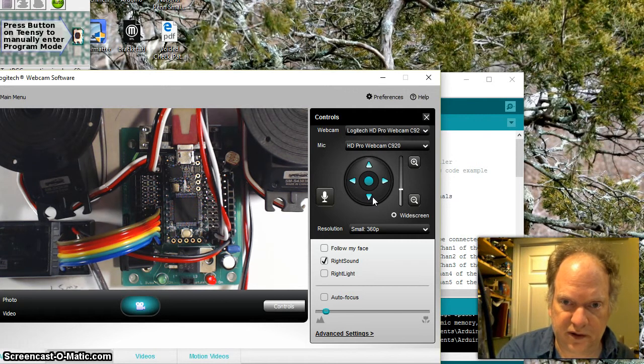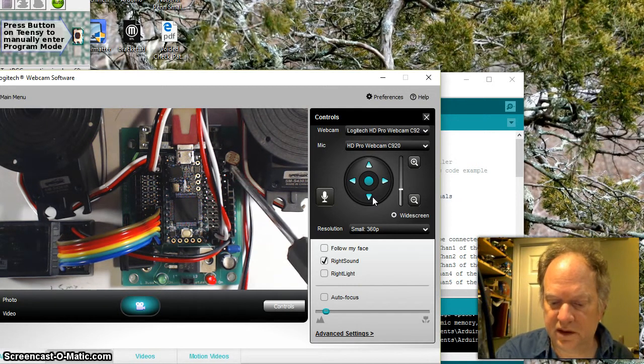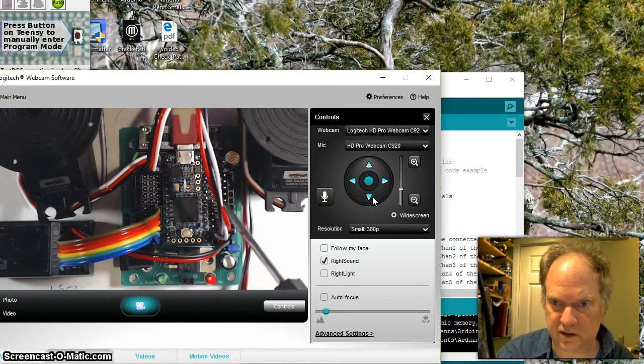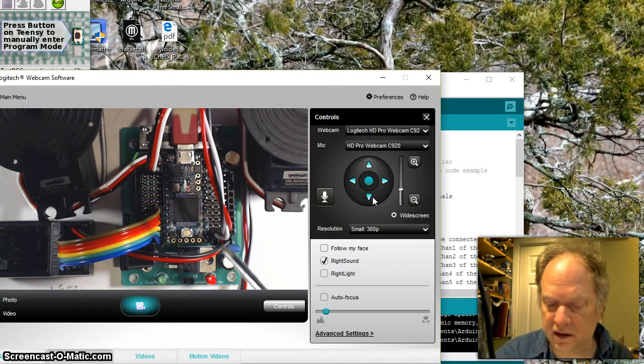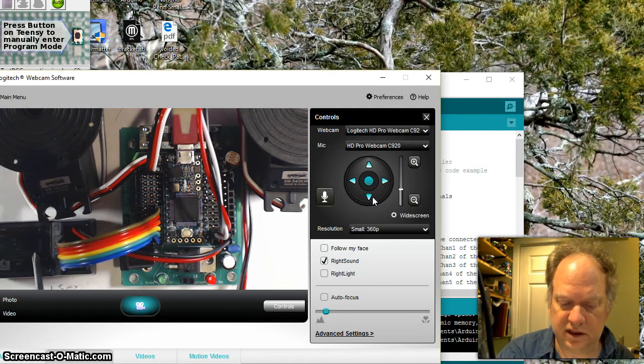Over here, where the battery hooks up, I have this 2 filament wire connected to this side of my motherboard, supplying 5 volts. Notice that the black wire is on the outer edge. The red wire is connecting to the inner set of pins. These are the ones that are going to be powered. It's tethered with this USB, so it's getting 5 volts from my computer. I won't even need to turn on this switch because I have nothing from this RC hooked up to the power supply in this side of the board. So the signal pins will be unaffected. I'm just going to be taking data from this receiver into these pins here and then processing them, and then we're going to look at it displayed as a printout.